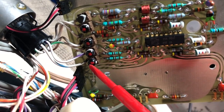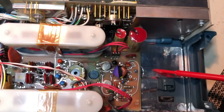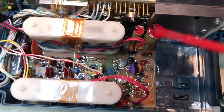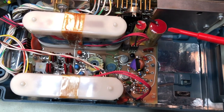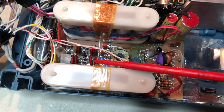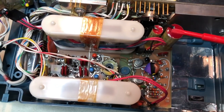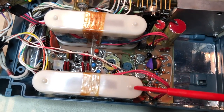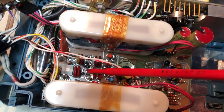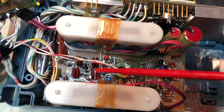The fifth transistor is for the unblanking signal. That's the CRT. Coming back to the power supply — the input AC comes in here. They don't use a transformer; rather a resistive divider. The reduced input voltage is then rectified and fed into a DC-to-DC converter which converts these voltages into the internal voltages required for the whole unit. If there is AC input it'll work from that; otherwise the battery supplies the same voltage to operate the DC-to-DC converter. There's a voltage multiplier sitting here that generates minus 1000 volts for the CRT — so be careful, even if it is tiny, it can still give you a zap.